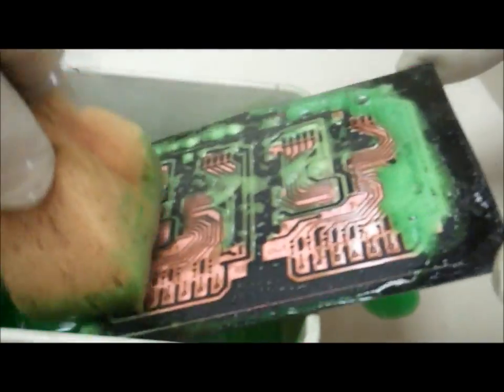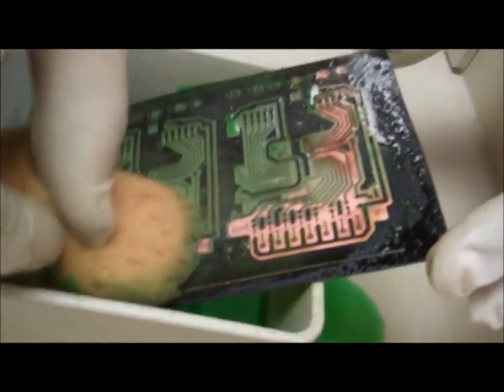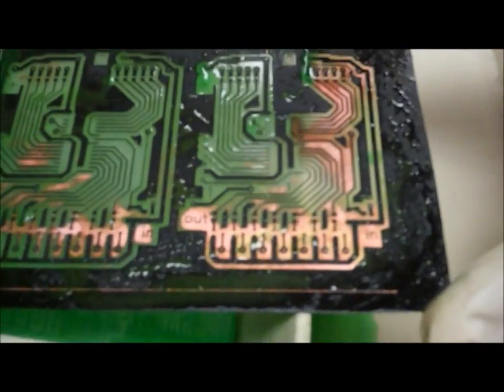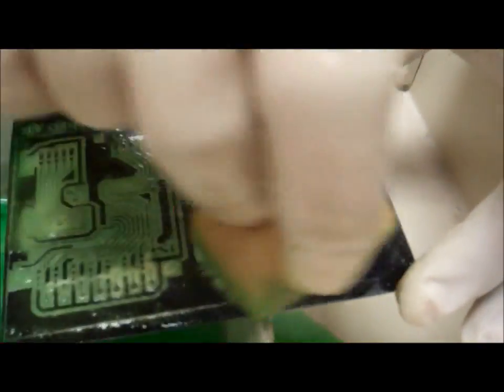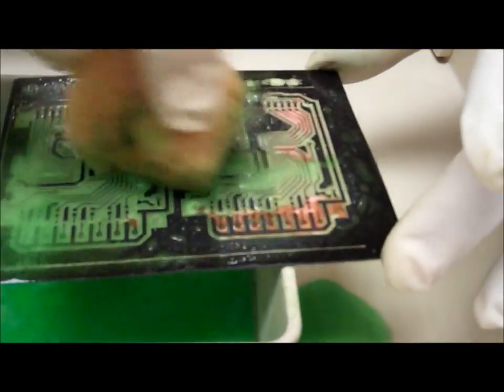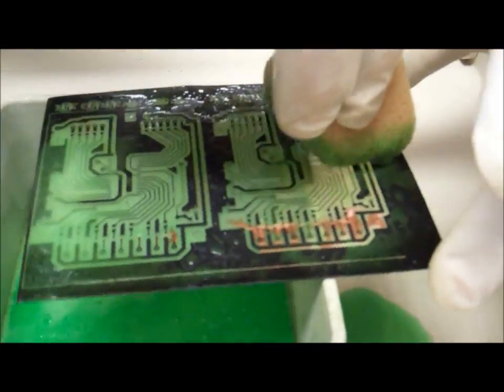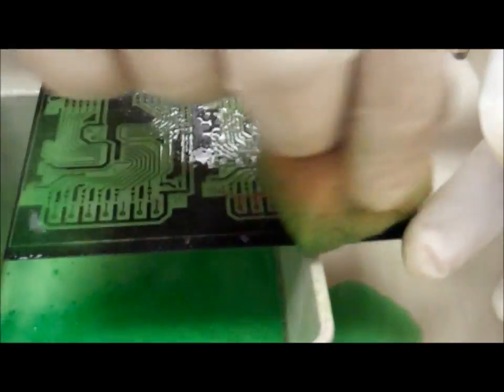What I'm getting off of this is actually steam. It is a little bit acid-smelling — you can see where I got the extra drip tray. But the center of the board is already etched through. All I have to do is get the edges now. You can really see where the copper is starting to disappear. The one problem is it etches so fast it tends to undercut a bit if you aren't careful.